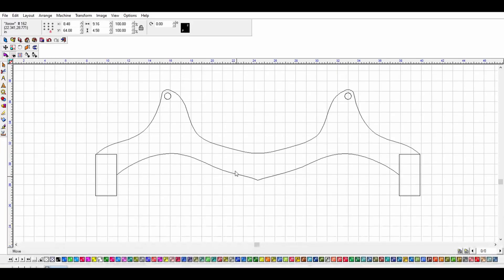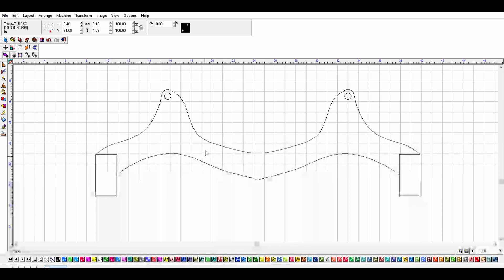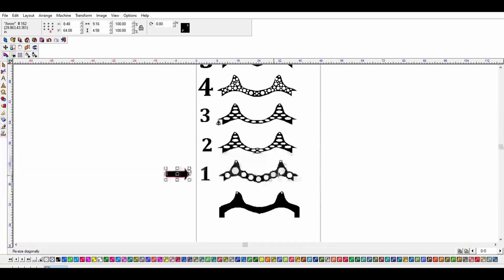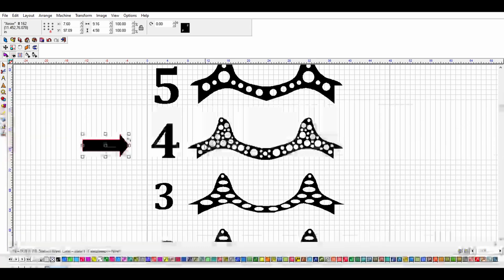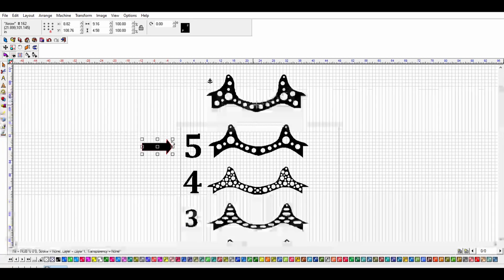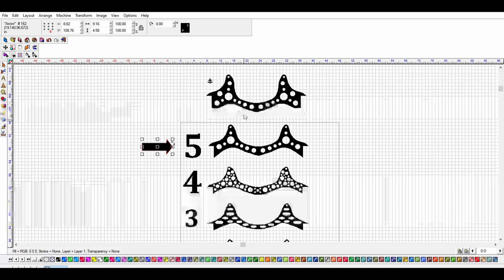We've got these measurements - time to come in here and start drawing up some fun stuff. I started out with some squares for the frame rails, then got the holes in there for where the motor mount bolts need to go, and started drawing out a cool-looking design. You need some holes and stuff in there, so I started stretching it out and trying different styles. I got up to number four and it wasn't too bad, but I was worried there were maybe too many holes. When I got to number five, that was the one I was really starting to like. I dropped it down a little bit lower so I'd have enough room for an aftermarket oil pan if I wanted to. Then it was time to go to the plasma table, cut some parts out, and get to welding.